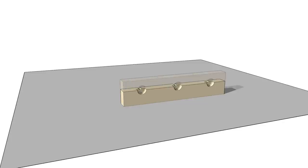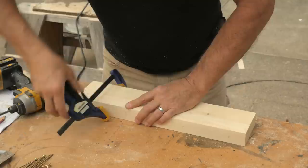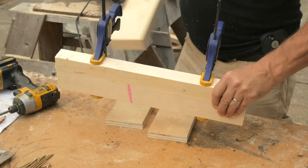The bolt block is made from two pieces of framing lumber. I rip the upper and lower pieces from a 2x6. I rough cut these an inch longer than needed, as I will trim to final length after the pieces are screwed together — it's easier to align this way. I mark the location for the three bolt holes and mark the screw locations between them. I use four screws to attach these two pieces together — I clamp them, drill pilot holes, then run the screws in.